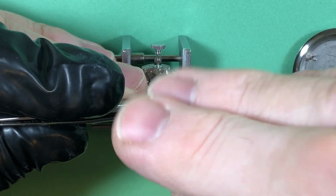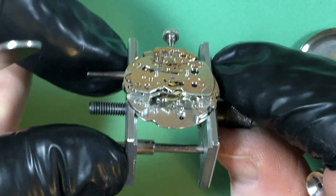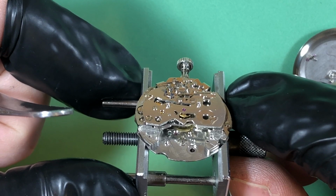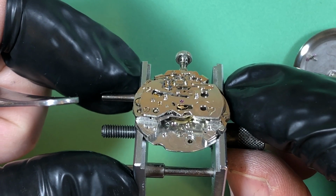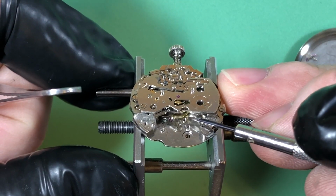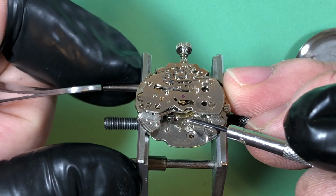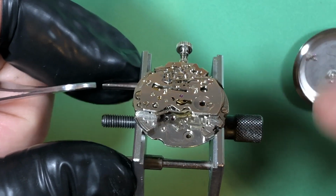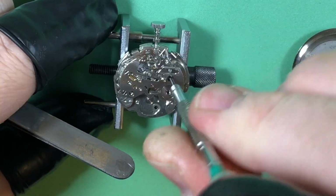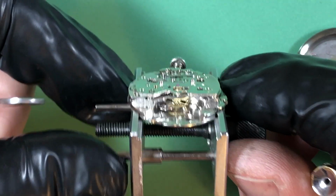Okay. Power into the mainspring. Oh yeah, see, and it's nice. I got the lower mainspring arbor jewel where it should be. You can tell because of where the teeth on the mainspring barrel intersect with the central gear on the pinion for the center wheel. Yeah, smooth.